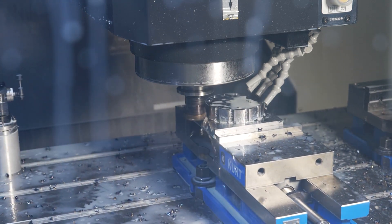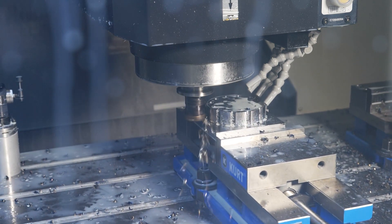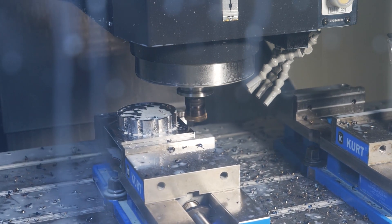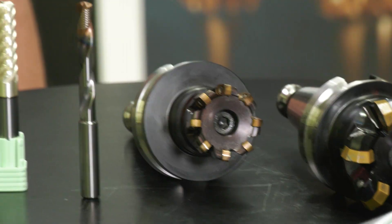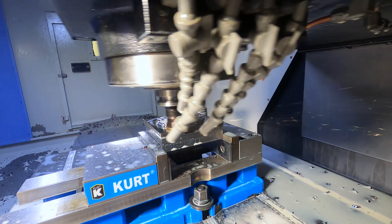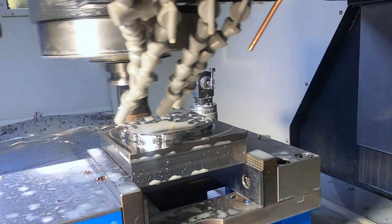In this demo we hit eight meters per minute — having eight inserts in there enables you to do things like that. Everybody wants to go faster, and it's about utilizing the machine tool more. The key is doing it safely. The inserts can take it, the steel body gives it security, and it's just pushing on and doing the right things for the end user.